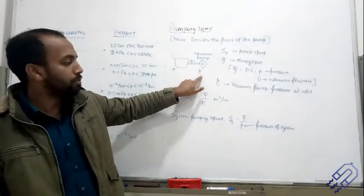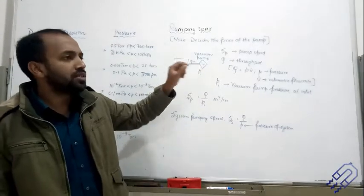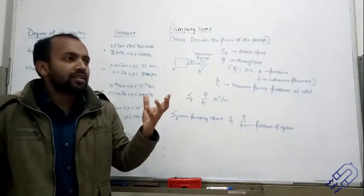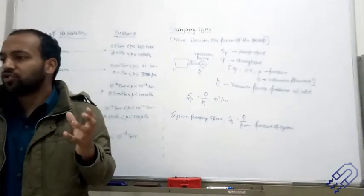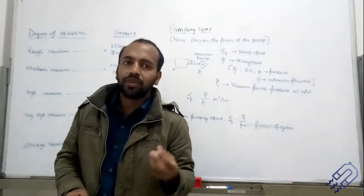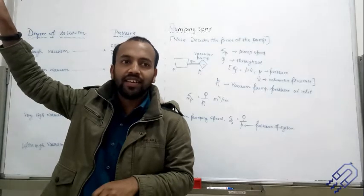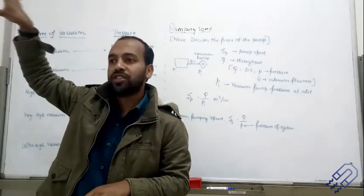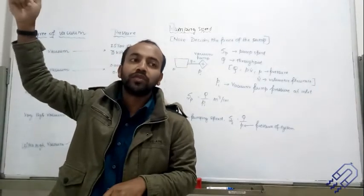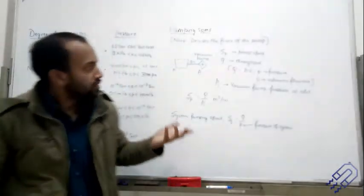The plus symbol here basically denotes a rotor — you have a motor with a fan attached to it. Think of your kitchen exhaust fan: you have the kitchen where you're cooking and gases are coming out from cooking. There is a small outlet on top and the fan is attached there. The fan is outside, rotating in the reverse direction with respect to the gas, dragging the gas from inside to outside. That is how an exhaust fan works, and a vacuum pump does the same thing.